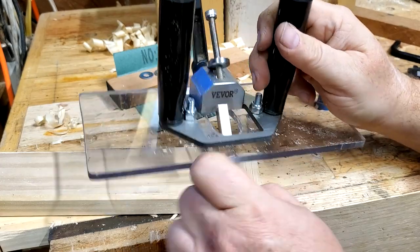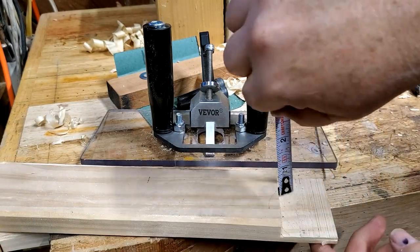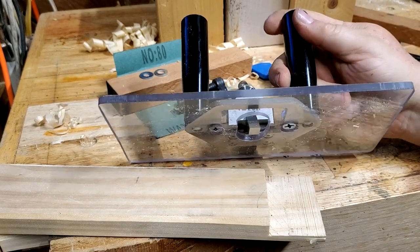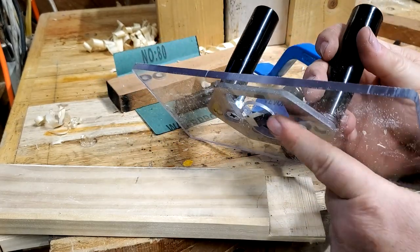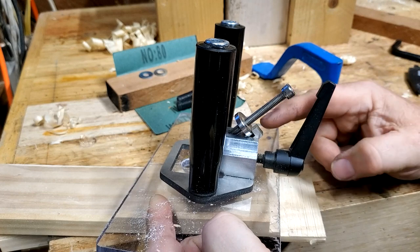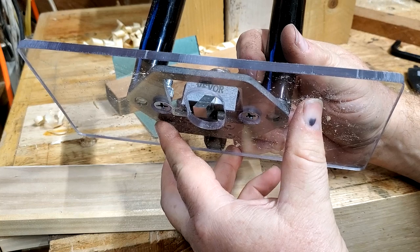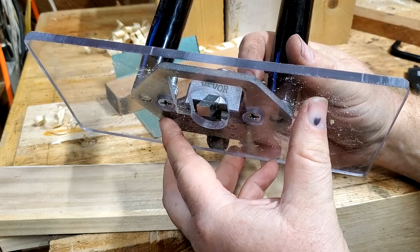The problem I found is when I went to test it — my cheek is pretty deep, a little more than half an inch. I can't get that much extension out of it anymore. The quarter-inch used quite a bit of the travel. I measured this and it's only about three-eighths of an inch that'll extend, and then it bottoms out. So the cutter really isn't long enough to do what I wanted. It's not the end of the world because three-eighths of an inch is what you'd need for a normal half-lap joint in a three-quarter inch board, but I'd like to have a little extra.